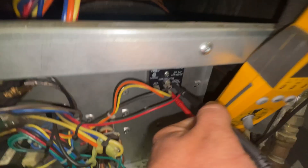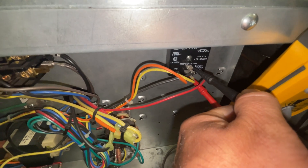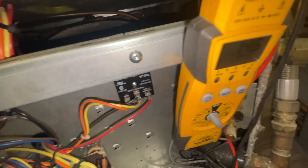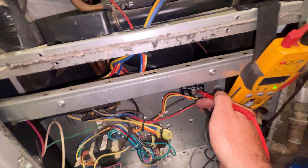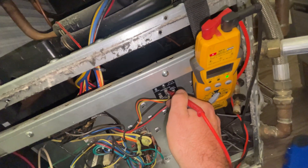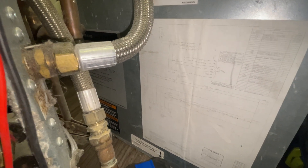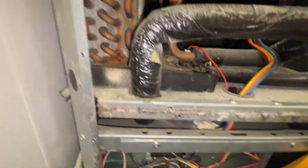This should be closed. We have 24 volts between the two points, which means this lockout relay is open. When you remove power to it, it should close — power is removed and we have continuity. You can see this on the diagram. I'm mainly making this for my work colleagues at this particular property, but follow along if you want.